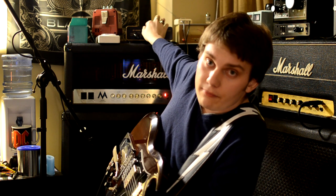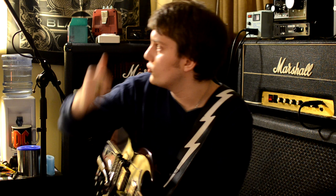I have another one on this amp here. This one is a Gibson Power Stealth — the same thing as a THD Hot Plate if you've ever heard of that — and this one over here is a Weber Mass 200. They both do the same thing but work in a slightly different way. The Gibson Power Stealth is purely a resistive load, while the Weber is a reactive load, so it has a dummy speaker inside to make it sound more natural and more like a real speaker without affecting your tone as much.